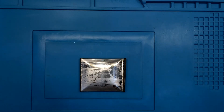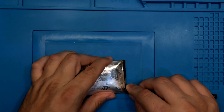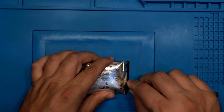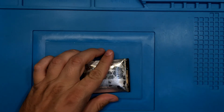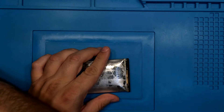Most contacts plates have much more to them than just contacts. There can be other electronic components too — for example, a temperature sensor, electric flow meter, charge cycle counter, and so on. Contacts plates are usually only glued with double-sided adhesive and do not require much force to peel off.